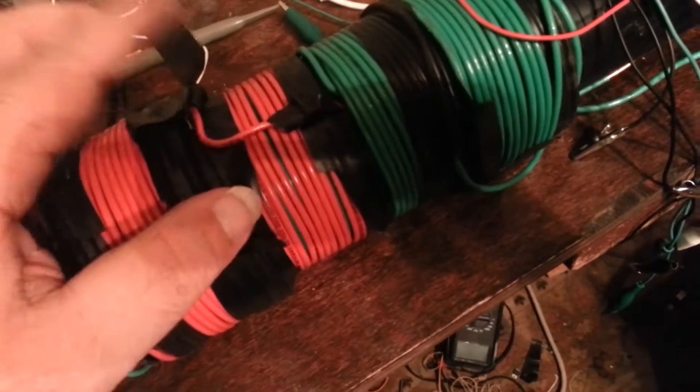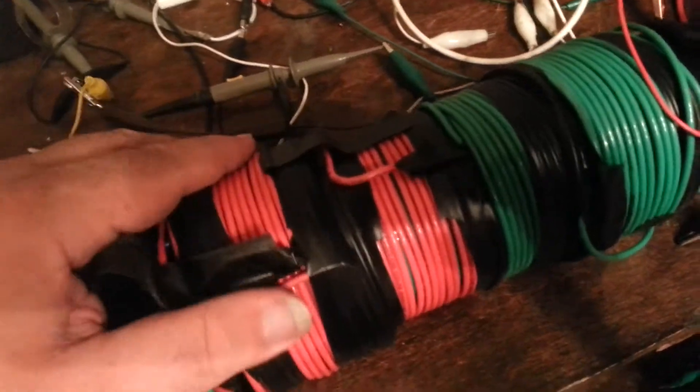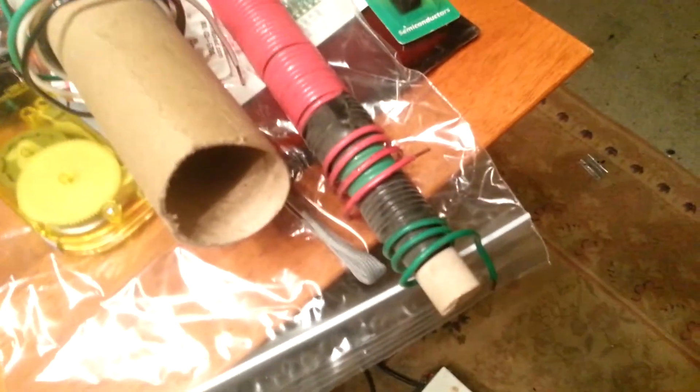All three of these. The bottom layer is green — there are two layers of green — then this half is red, and it's patched together with jumpers like this, and there's a solder joint somewhere. The first crossover is there, the second crossover is there, the third one should be here — I guess that's what slipped. I was having problems with this being kind of loose, and adjusting it influences the frequency, but it's all low power steps, and any stray capacitance affects it greatly. These are caduceus coils wound clockwise and then counterclockwise on top of each other — not clockwise and clockwise. Thank you.